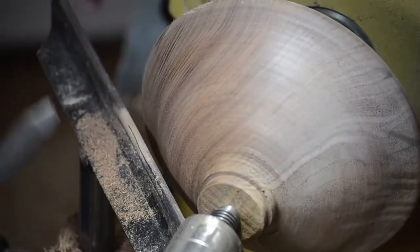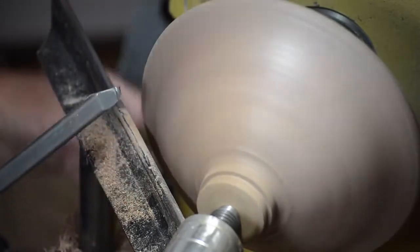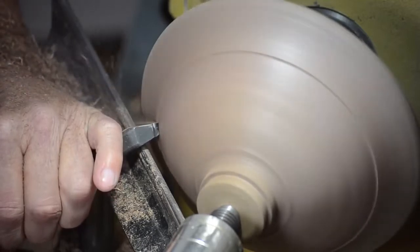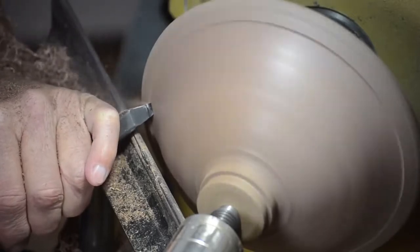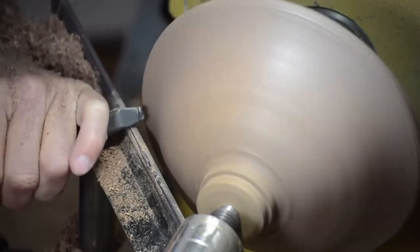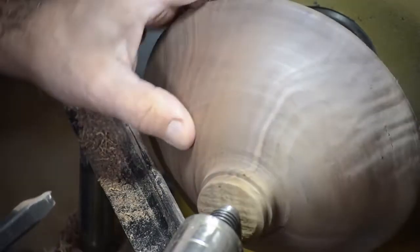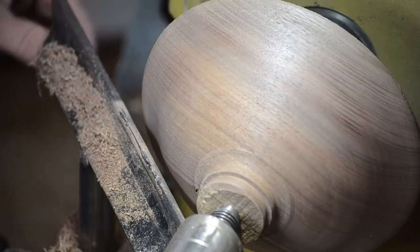Still a pretty good surface overall. I'm going to make another pass out here where it's just a little out of round. Turn the speed up a little more. I'm going to take a hit there — not very much cut at all, it's really shallow. Move my hips to the right, move them back around to the left. Clean that surface up just a little bit better right there because a little lighter set. That will easily sand with 220 grit. I'm going to have to go back and finish that when I reverse turn the bowl. But it's looking pretty good overall. So let me go back and show you how it works on the inside now.